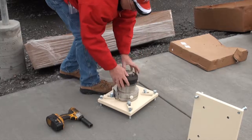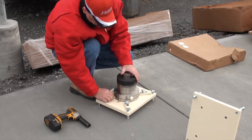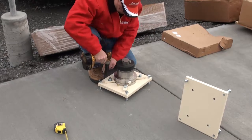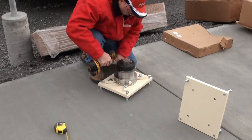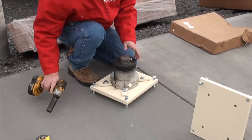Place a Guardian load cell on the top of each grout plate. Rotate the load cell so that its bleed port is facing out, away from the scale. Install the four load cell clamps and secure the retaining bolts. Proceed in this manner until all of the SST load cells are installed.